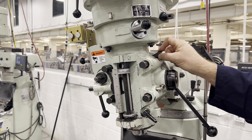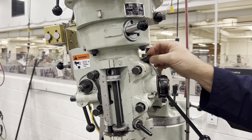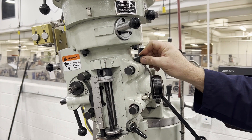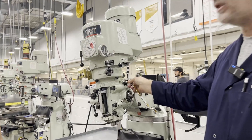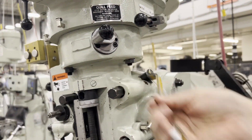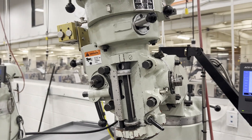This shaft has a groove cut into it for a retention screw, and that becomes a weak point. If you put too much force on this adjuster it'll actually twist off into a blind hole. The adjuster screw has been broken off, so it will just spin and won't actually turn the gear to make the adjustment to align the head.